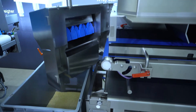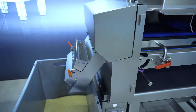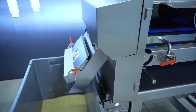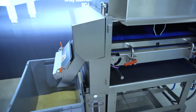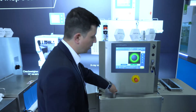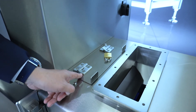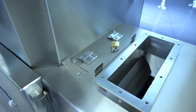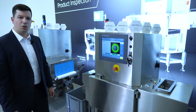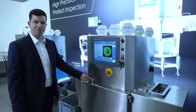What is also very interesting — and a unique solution for this machine — is the type of testing we have designed to guarantee your in-house qualification. You can close down the good channel and run manual tests with contamination inside your product flow, and those contaminated products cannot end up in your good channel during production. You don't have to adjust the infeed for this. You can open up this lockable flap and introduce a contamination sample into the product flow during production. This gives you an idea of how you can do product inspection for your bulk production.